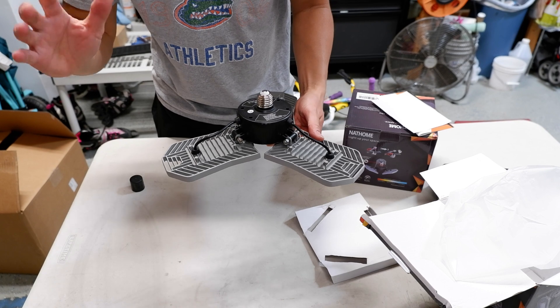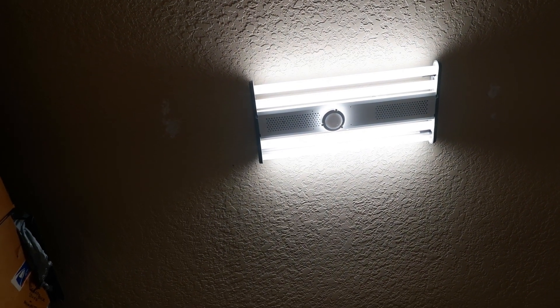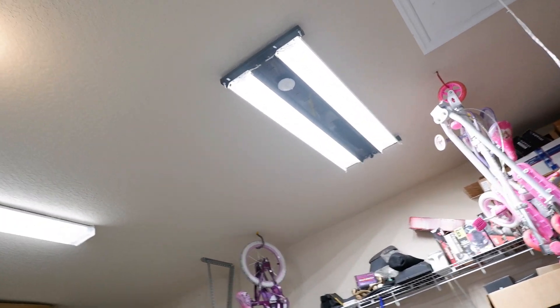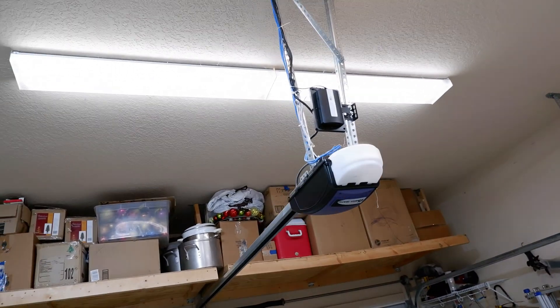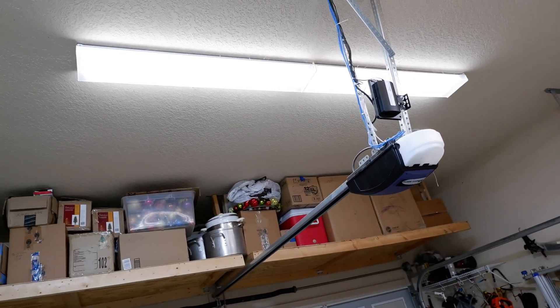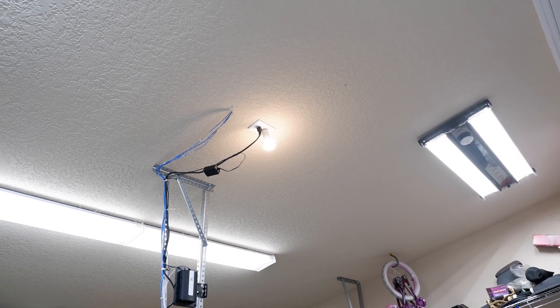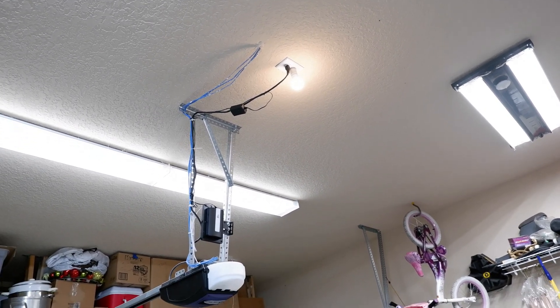What I'm going to do is run the test first with a regular 9-watt LED bulb and measure the light levels as a comparison. Like I was saying earlier, my LED lighting setup in this garage is crazy. I've got this one right here — probably a 170-watt — and that's probably a 215-watt fixture. Both of these are about 170 lumens per watt at the time I was putting them up. Then I've got this older strip with regular T8 LED bulbs, direct replacements using the standard fluorescent T8 ballast, as auxiliary light on a separate switch. The main fixtures have sensors on each of them so they turn off after about 5 or 10 minutes. So I actually just put in that regular screw-in 9-watt LED light bulb right there.